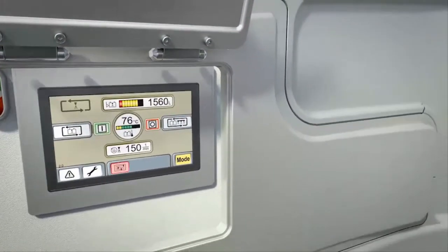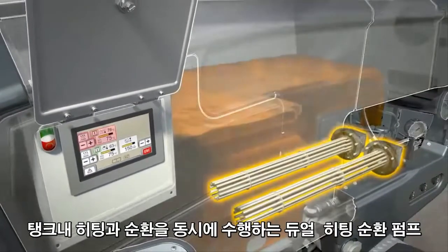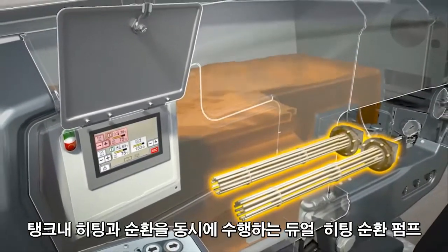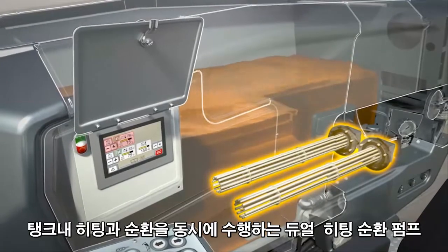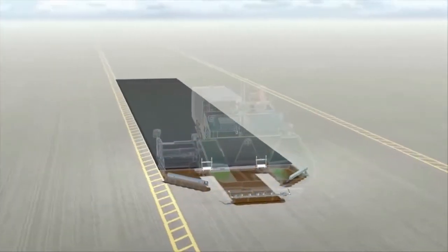The heating menu can be accessed directly via the menu Parameter Settings. The temperature of electric heating in the emulsion tank can easily be adapted to the emulsion being used. Nozzles are fitted to the five spray bars.